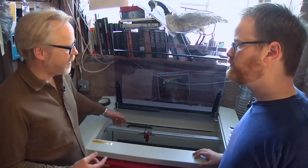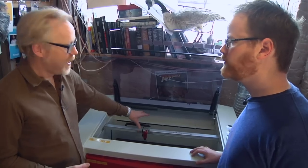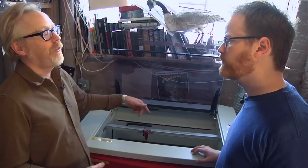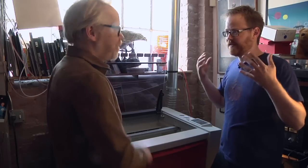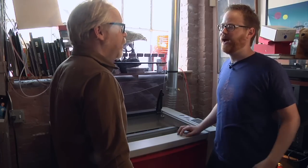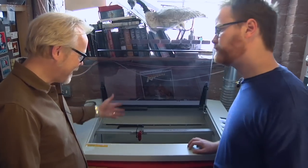It does make for a difficulty because the laser cutter produces smoke when it cuts. And that smoke can get in the way of your beam, or it can get on your first surface mirrors and burn right through them, and they're expensive. Optics for this are expensive. So if the mirrors get dirty, the stuff that's on the surface actually heats up and it'll catch on fire? Precisely. Wow. It won't catch on fire, it'll just burn right through the glass, or it'll mark it so it doesn't work anymore. Nothing major. So you have to keep everything really clean.